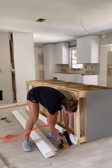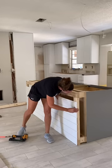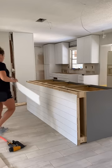To cover the back wall you can use a cabinet panel, or I decided to add a little character by adding shiplap. I bought these shiplap boards from Home Depot and cut them to size. I used my brad nailer to attach them to those 2x4 studs. When installing shiplap, I like to start from the bottom up so you see a full piece along the bottom, and if you have to cut a piece it will be at the very top and hidden by the countertop.